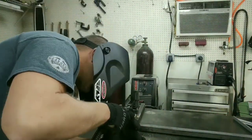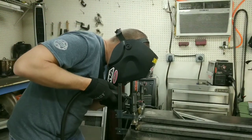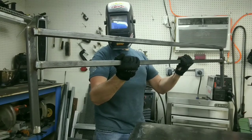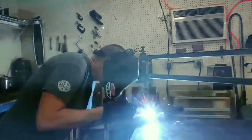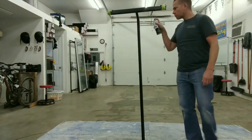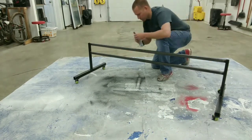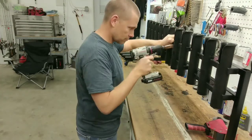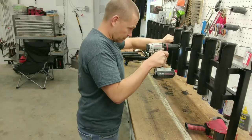If your cart is not going to hold 24 rods, you're going to want to change the length of the trusses. The rest of your dimensions will be the same — just adjust the length of the trusses accordingly for how many rod holders you want on the cart. I just use self-tapping sheet metal screws here because the trusses are only 16 gauge steel, and that's pretty easy to drive those screws through.